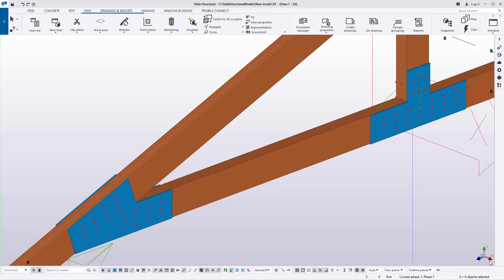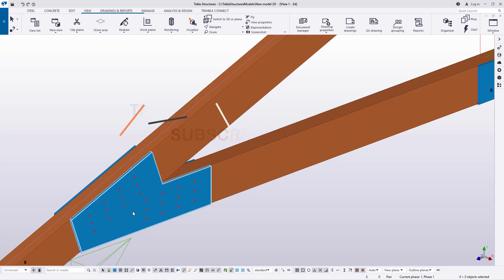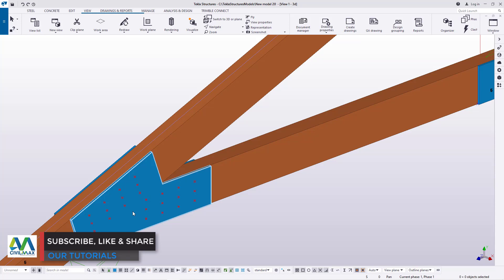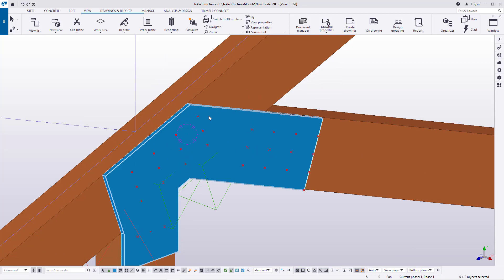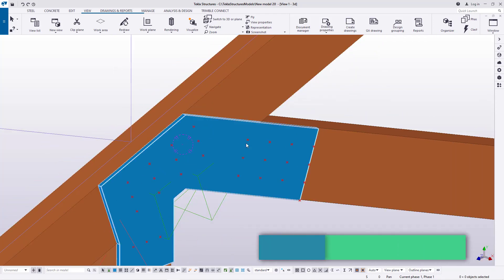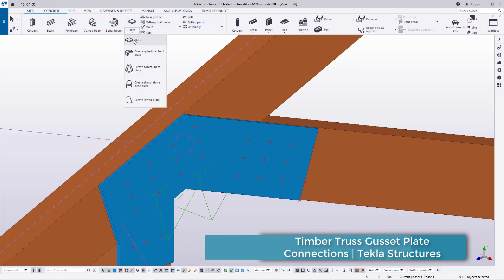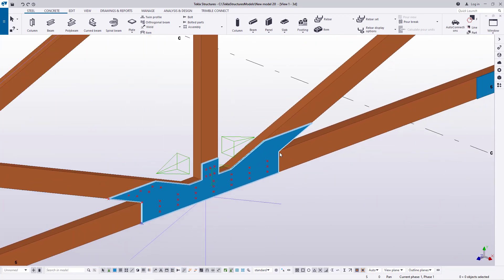Hello, welcome to this tutorial. We are going to create connections between the top and the bottom chord of this timber truss using gusset plates. You can see on screen that between the connections we have already placed the plates, but we've not included the bolts or any type of bolting. I placed these plates to cut down on time — you just place your points and follow the contour using the plate tool, then pick on the plate once you've defined the profile.